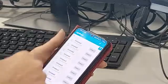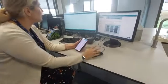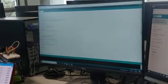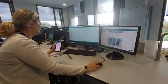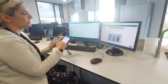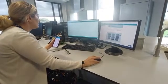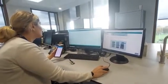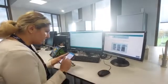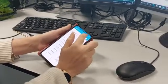When you open the app I have lots of Bluetooth transmitters around me. The particular one I'm interested in is the one I wrote the code for. I've changed the name from the default — this line sets the device name — so you should put something personal that you can recognize. I put 'My Nano 33 IoT'. When you press the icon on the top it sorts them based on signal strength.